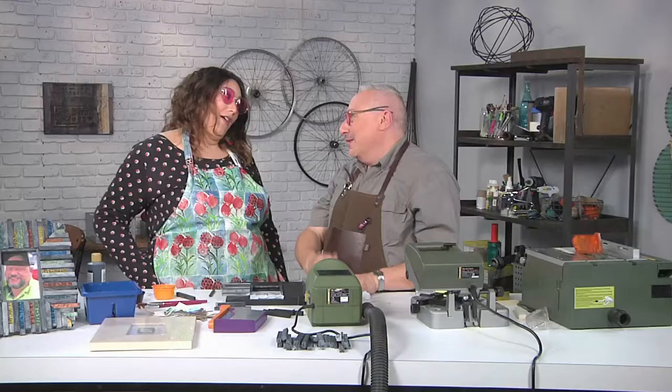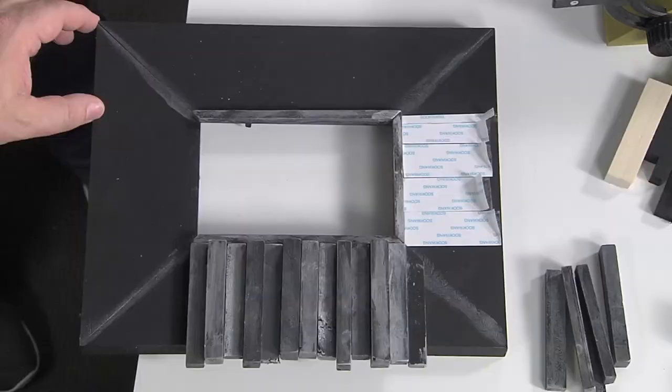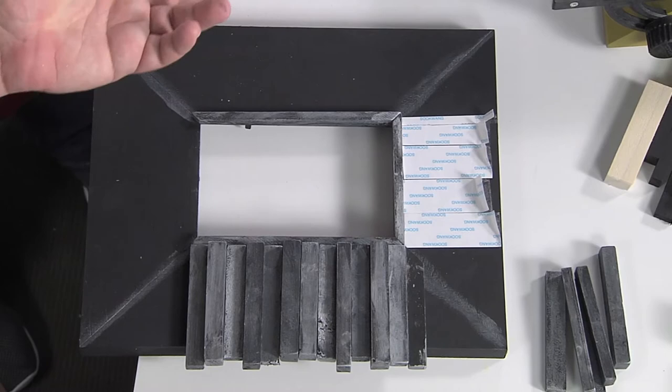So how do we finish assembly? Yeah. So I used a double-sided adhesive tape, and I learned the first time I put tape down the whole edge. Well, then I had to have the mitered pieces ready and lay everything out at once, because once you peeled it, it was exposed to dust and stuff. Now I learned, okay, let's just do this segment.